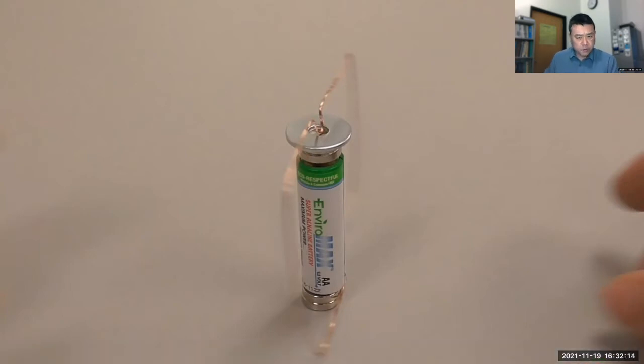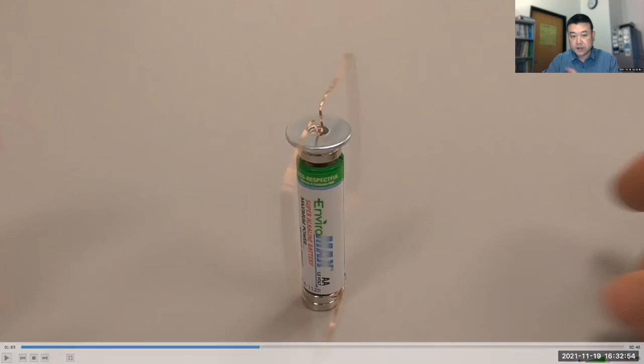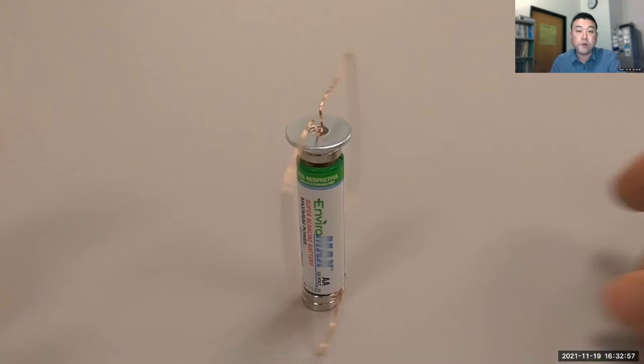It's called a homopolar motor because of the design of this arrangement, which is different from the other motor you have seen. In the other motor, we had to deliberately make the electrical connection asymmetric so that the pole of the electromagnet in the coil loop switches. So the direction of the magnetic pole produced by the current is changing as it turns one full turn. In this arrangement, it doesn't change. The direction of current stays constant throughout the entire revolution. That's why it's called a homopolar motor.